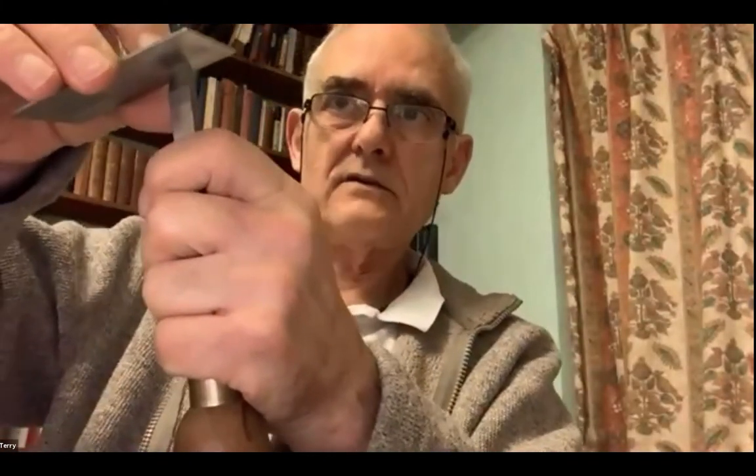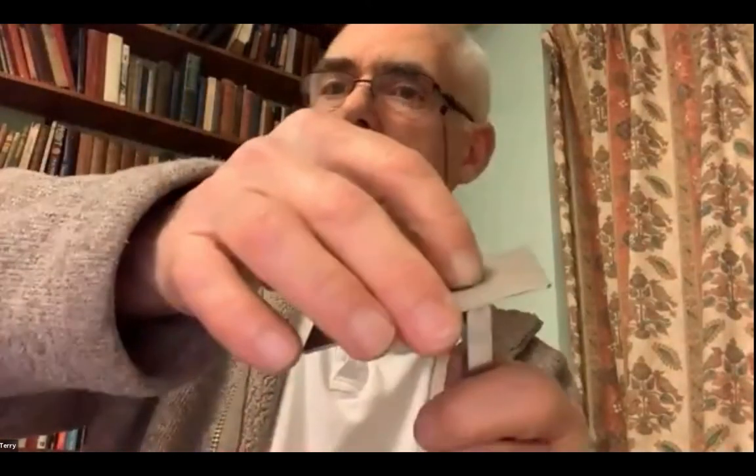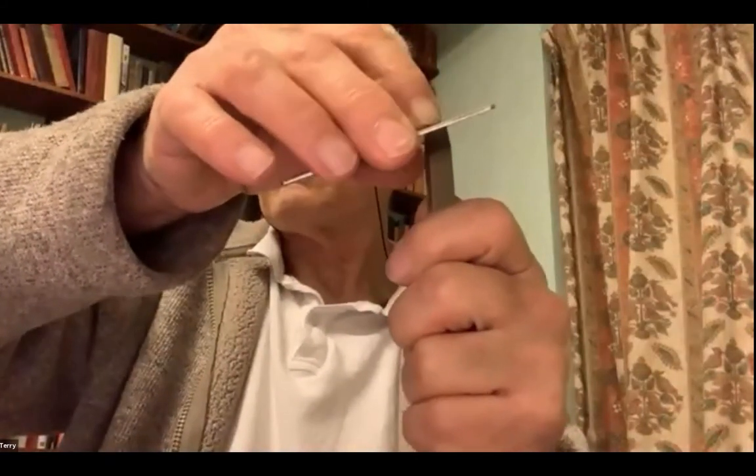And the skew angle, that's the angle there, like that. Can you see that? That angle should be about 70 degrees. Is that showing? Yes. But again, plus or minus, it's up to you. And of course, you can sharpen these with a curved edge, and some people prefer that. These things go around. They go into fashion, they go out of fashion.